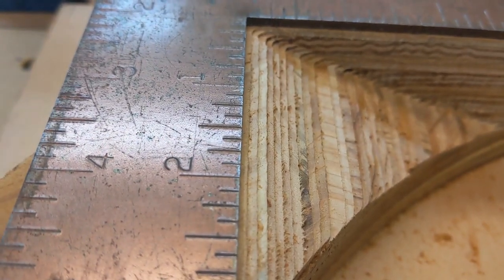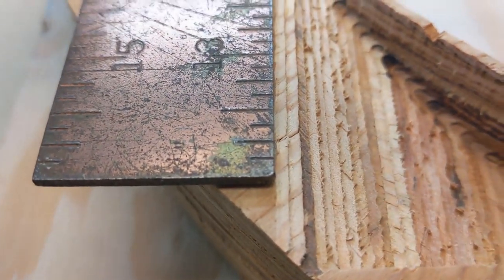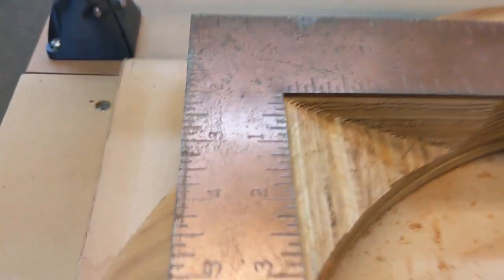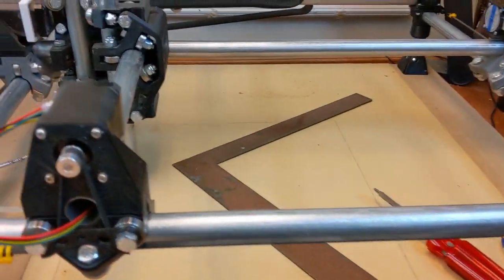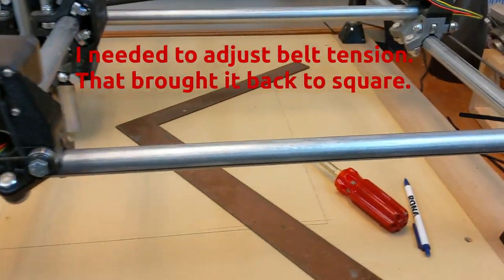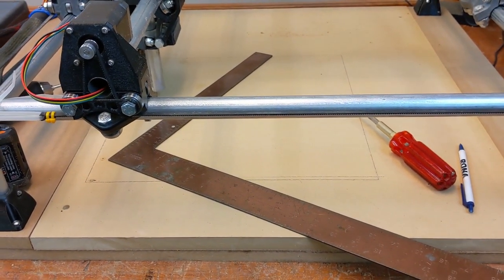It's cutting rhombuses in the XY plane, because these sides are trued up against those two edges - that edge and that edge is trued to the square - but there is a definite gap on that side. So I am that much out of square. It's time to cut some new blanks for the mistake that I made after not having my machine trued up after it running into end-stop problems. But I've got it nicely squared up again, so I can cut a new blank and then try to do some more routing of the let for the bearing.